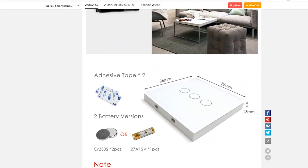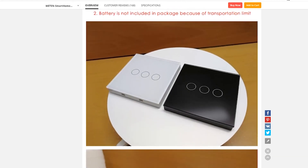These are radio frequency switches that talk to a box which then talks to Home Assistant. The RF switches are just like normal switches that can be controlled with something that sends RF signals — normally a remote, but the RM3 Pro also does this. The problem with Wi-Fi bulbs is that the light switch has to be on all the time, so I blanked off the old switch so it's always live — not recommended — and use these remote buttons that can be put anywhere. They also talk to the RF box, which talks to Home Assistant, which turns the light on or off.